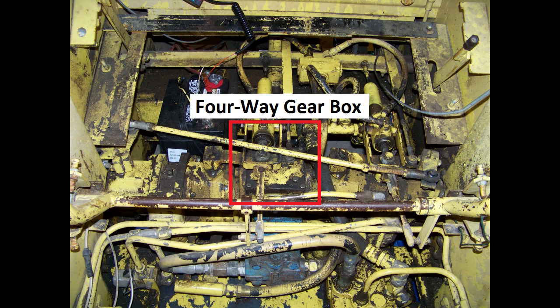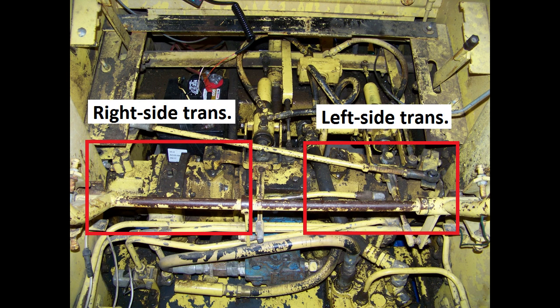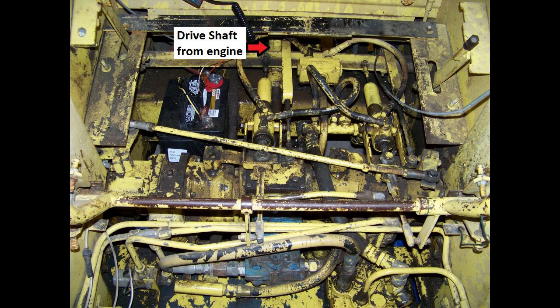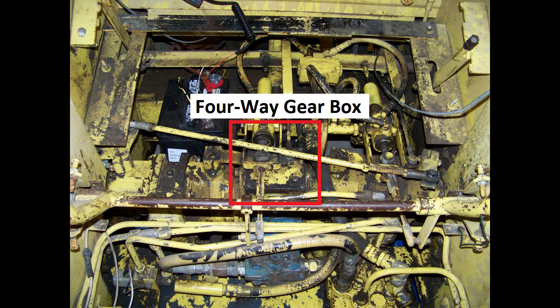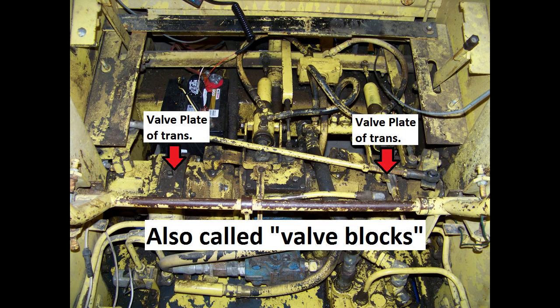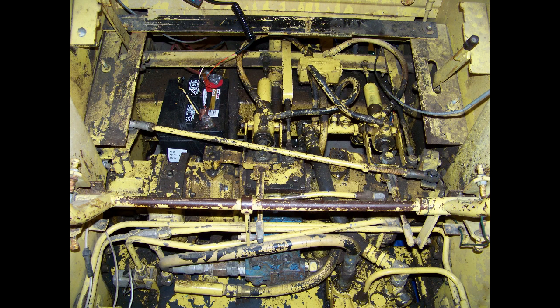You can see another video I did on the four-way gearbox. Then you have your right side transmission and your left side transmission. Each transmission has three parts: the inside parts have pinion gears which are run by the driveshaft from the engine to the four-way gearbox — those sides on each side are the pumps. In the middle you have the valve plates, and on the outsides you have the motors. So each transmission has a pump, a valve plate, and a motor.